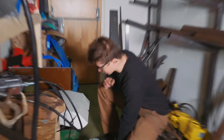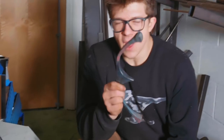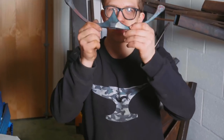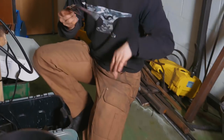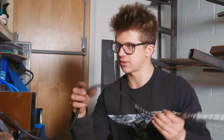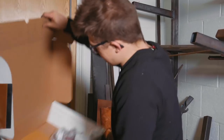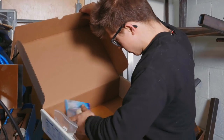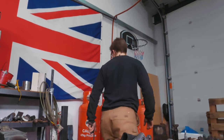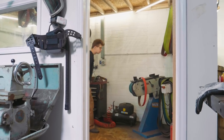So in regards to finishing this, now those boxes are out of the door and the workshop's a little bit clean and tidy: the ideal would be a wire wheel on a bench grinder; second ideal, wire wheel on an angle grinder, but it'd be difficult to hold onto this without marring it in the vise. Third ideal would be a wire wheel on one of these flex shaft things, but guess who was a numpty and didn't order any wire wheels for it — I was that numpty. So I'm looking for a wire brush, and I've got it.